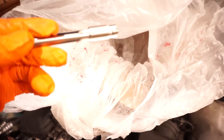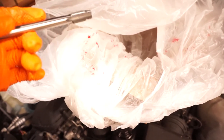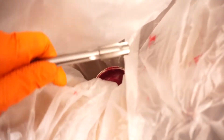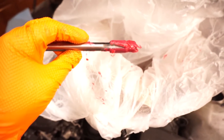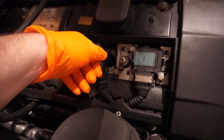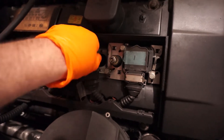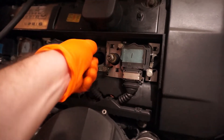The first thing I'm going to do is take this tap — it's a dual tap — so it's got threads to get it started and help it go straight, and then it has the new enlargement threads. Inside the kit there's a tub of grease, just to keep things clean. I'm going to stick the tap in the grease and basically cover it. This will allow the chips from the metal as the threads are cut to hopefully stick in this grease. I've put it in the hole and started threading it in by hand — it's kind of grabbing, so that's good; it will self-center and then tighten up.